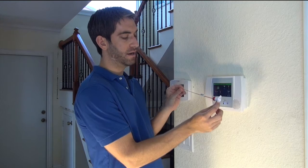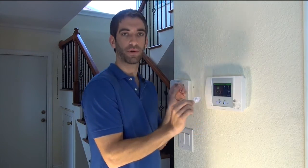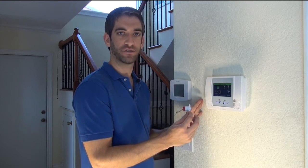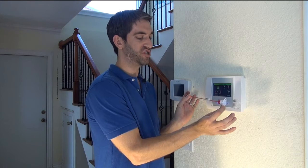This is an antenna. Make sure that when you install this, the antenna is extended and not bunched up or coiled up, because that will reduce the range. Typically in your frame you're going to have just open wall once you get past your studs, so just make sure you drill through and install it so that it's fully stretched out.